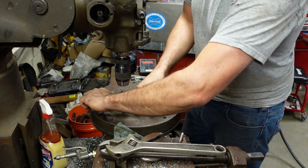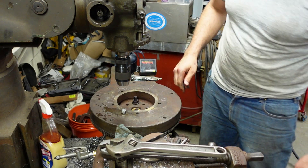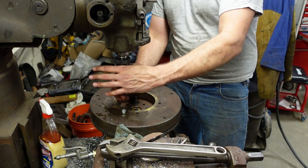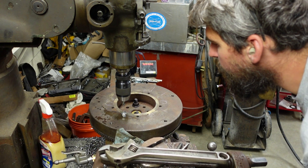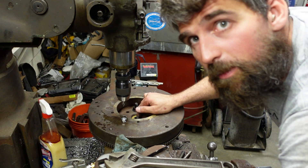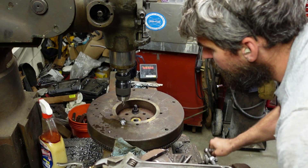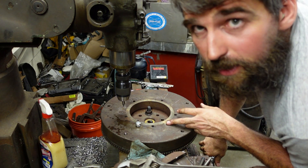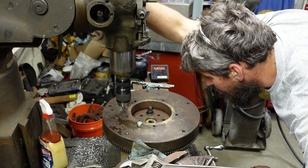That's it — only cutting the very bottom of the hole. That should let me thread the bolt just about to the bottom. Perfect. I'll do the same thing another five times. If you have DRO — which I wish I did — you can mark the center, program in the bolt pattern, and just drive it until it says you're in the right spot. I don't have that, wish I did — someday I will. But if I had that I wouldn't have needed to measure all this stuff either. Since I don't have that, I've got the dimples and I've got to look real close and try to get it right on the money.